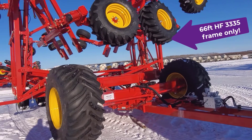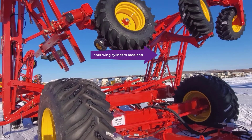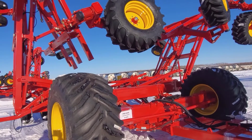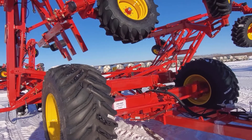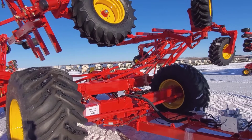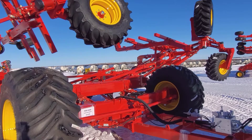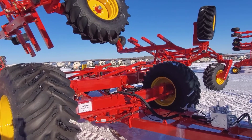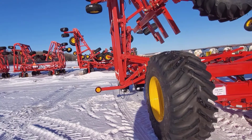We're going to pressure up the first base end of the inner wing cylinders. Always the side that's easier goes first, because the lines are tied together. You can see we're filling the base end of those cylinders. Soon the ball valve will close on that side, and the other side will start to move.